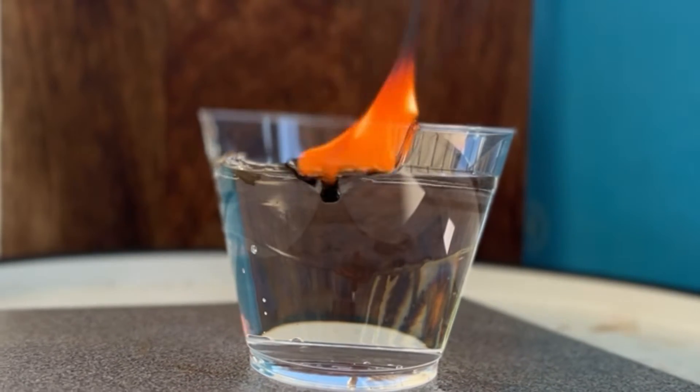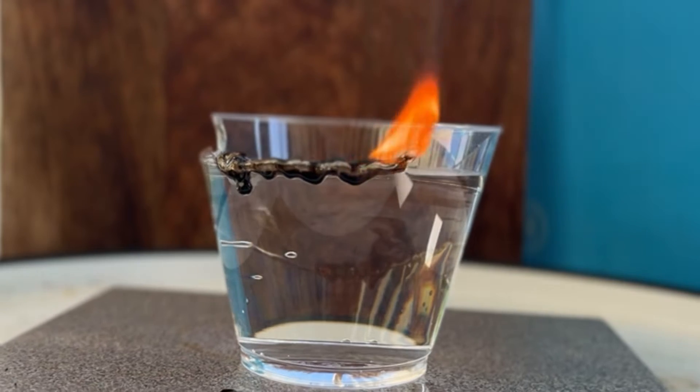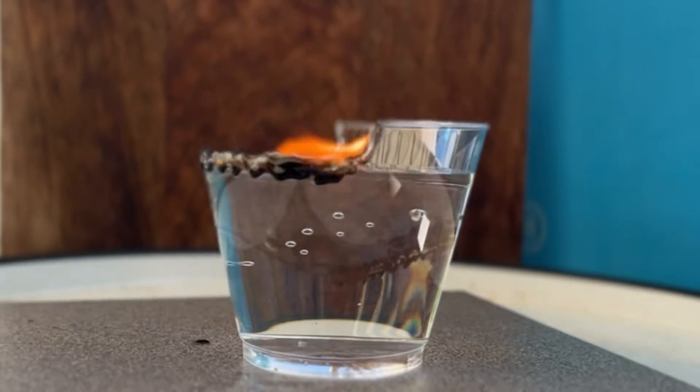I had a professor that would perform a burn test — burn a small sample of plastic to identify the plastic type and observe the flame color and the smell of the fumes. I wouldn't advise this, as some of the plastic burning could be toxic.